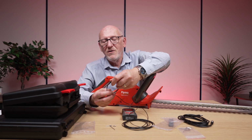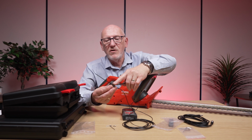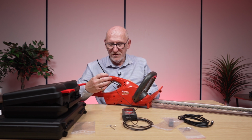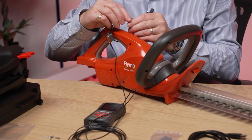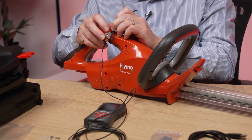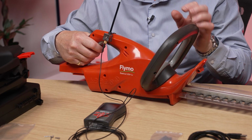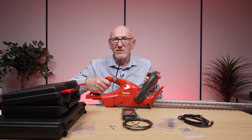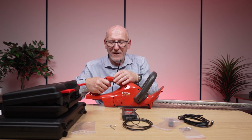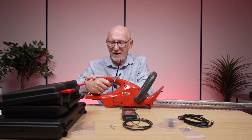So we've got our accelerometer here, and we've attached it to the block, remember, and now we've been able to put a cable tie through it. So what we're going to be able to do is to put this through here and tighten it. So this accelerometer is really, really tight against the handle of the tool. So when we're using it with our right hand here and our left hand here, we'll be able to get the acceleration from the tool handle that's coming through to your hand.